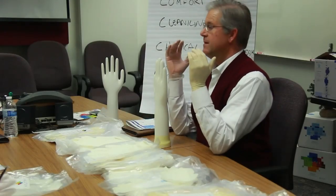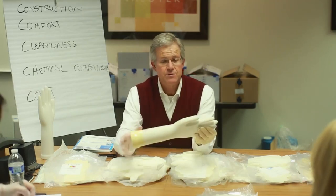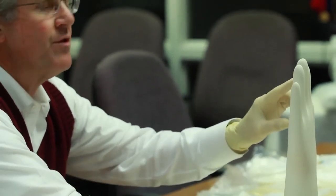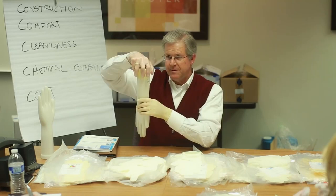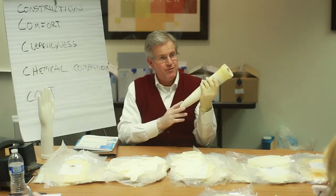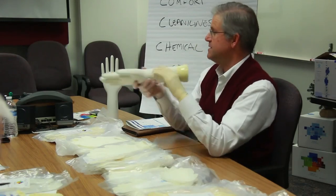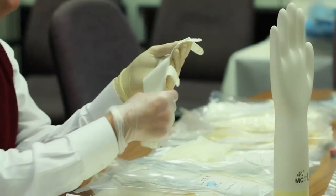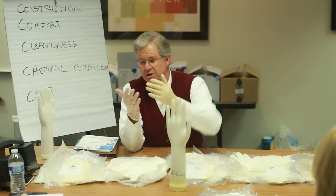The three substrate materials are PVC, latex, and nitrile. Looking at the former, upon closer inspection you'll see it has an 'L' on it, meaning this is a size large glove. You can see the textured fingertips — the glove is smooth in the palm and finger shaft, with texture at the fingertip. When dipped, the glove material mimics the shape of the former, then it's stripped and reversed, so the inside becomes the outside. The nitrile glove has a smooth palm, smooth finger shaft, but a textured fingertip.